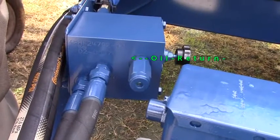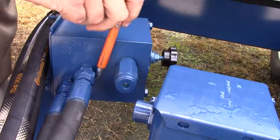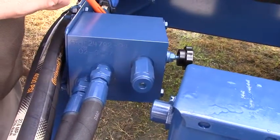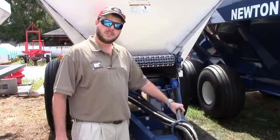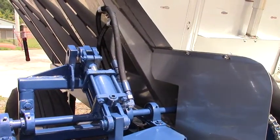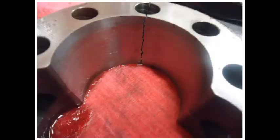Now we are looking at the front of the valve — we know it is the front because it has the pressure relief sticking out of it. This top hose is P1, which you can see stamped underneath, and T1 is on the bottom line. So it is inversed from the back of the valve where the open and close handle is — pressure on top, tank on bottom. The hoses running down the driver side operate the three-inch stroke hydraulic cylinder that engages the press wheel against the ground tire. Proper hydraulic line placement and lever control will prevent spinner motor damage.